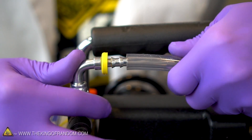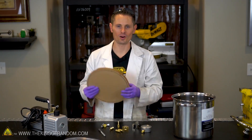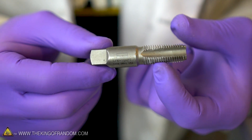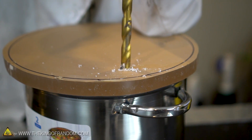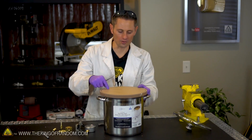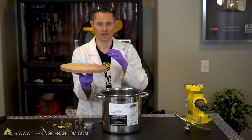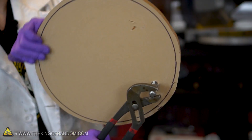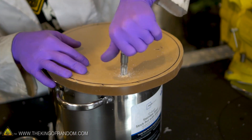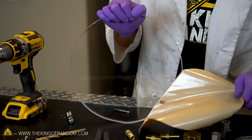Once our 90 degree hose barb is attached we can take our hose and just press it over top. So we've got our acrylic lid, our pot, and our vacuum pump — now it's time to put them all together. This little tool is called a tap and it's for making the ridged grooves for screw holes. This is a quarter inch NPT — that stands for national pipe thread — and for this we need a 7/16 drill bit for the pilot hole. I'm putting the suction hole closer to the side so that if we ever flip this over and use it as an acrylic base with a glass bell jar on top, the hole won't be blocked by objects in the center. Now we have a threaded hole in our acrylic lid. Let's remove the paper, throw on some thread tape, get all these things connected together, and finish up.